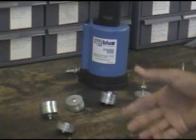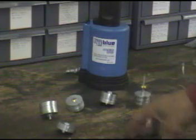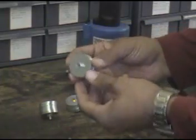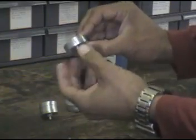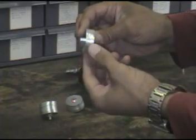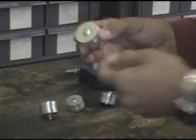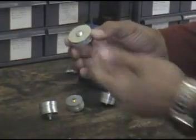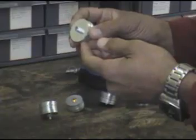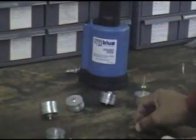Let's talk about some of the differences between Orlok structural rivets and typical structural rivets commonly used in the marketplace. Here's an example of a typical structural rivet. This has about as wide a grip range as you're typically going to see on a structural rivet, which is about 5/8 of an inch. Structural rivets do have a locking feature — this particular rivet has a locking feature in the head. However, on the backside it does not have a locking feature, nor does it have a backside flange. So it has a one-sided locking feature and is limited in terms of the grip range that can be applied.